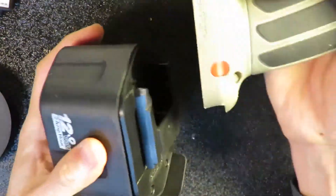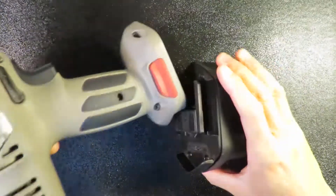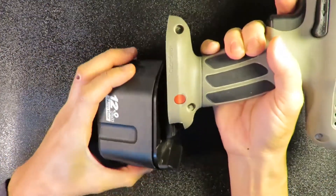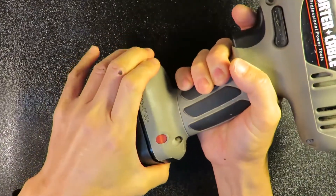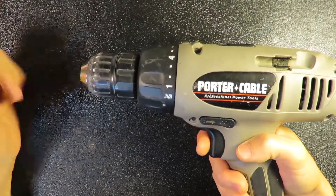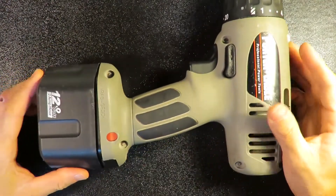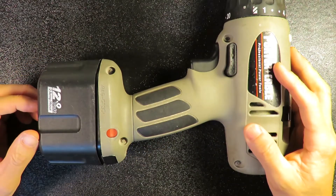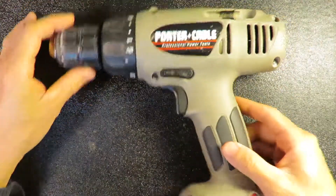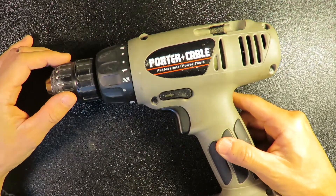Let's give it a quick try — everything is fine. Now the battery is charged, so let's give it a test. It works perfectly! So that is today's DIY project — basically using 18650 cells plus a BMS circuit board to replace the original batteries for the cordless drill. If you like my video, please give a thumbs up or leave your comments below. Thank you for watching.